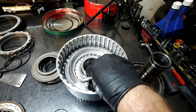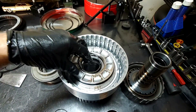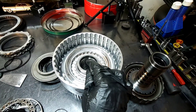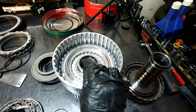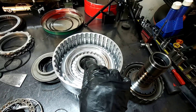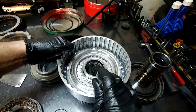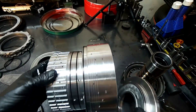This is a Ford, but you do a balanced fluid on this piston — that's what's leaking off. So you're losing all the oil here with the sealing ring moving all the way up. By the sleeve moving down, it's causing some other issues in the D and the F — this is the CDF drum.